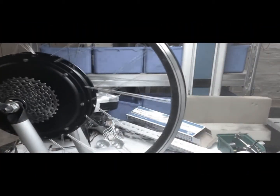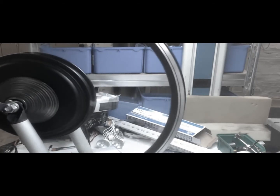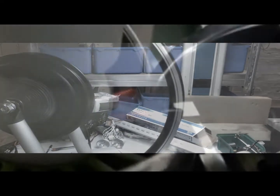The brushless motor is constructed with an electronic circuit that switches the power on and off in the copper coils, which in turn creates forces in each one of them that makes the motor spin. Some of the advantages of brushless motors include high torque to weight ratio — there's more torque per watt — which leads to increased efficiency, increased reliability, reduced noise, and a longer lifetime.